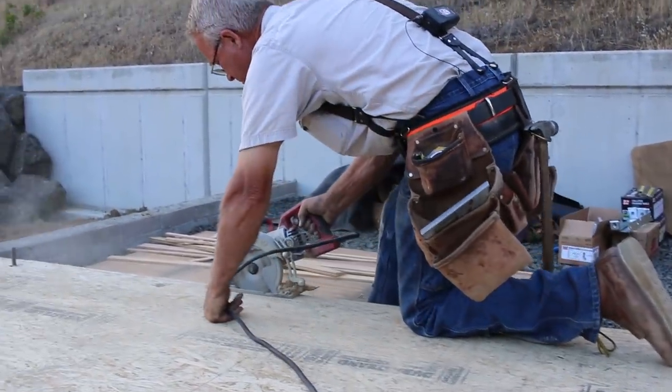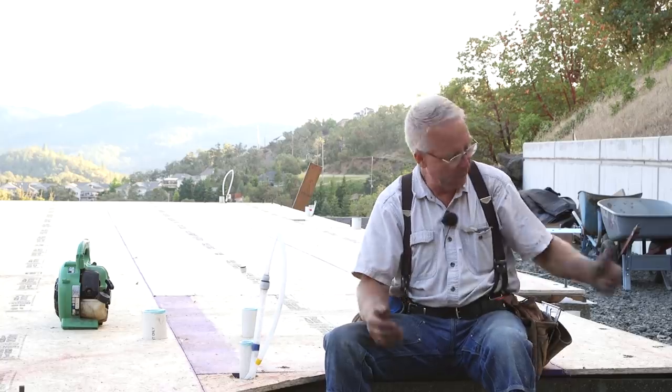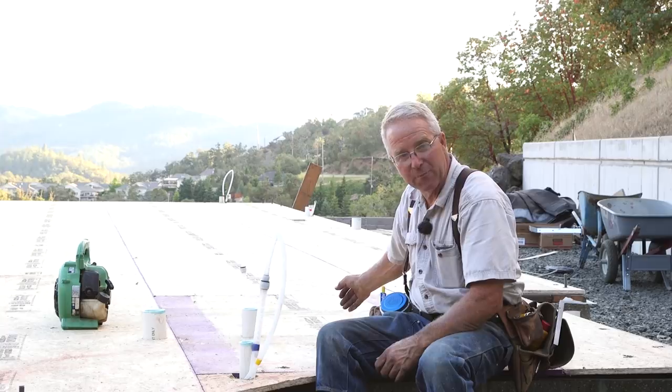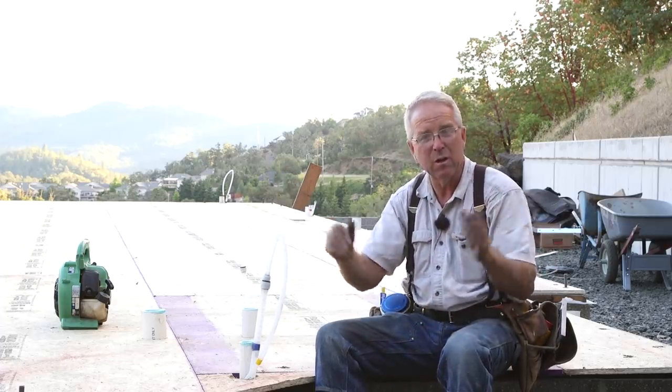Now back to the 5/8 of an inch net width reduction. If we were ordering trusses for this roof, or heaven forbid if the trusses were already ordered for this roof, I would have to reclaim that 5/8 of an inch someplace. And I would do it on the back of the house. I would let the deck, the diaphragm, stick over the edge of the stem wall 5/8 of an inch. And you know what? No one would care. It would not be any sort of a net compromise of the structure. If I turn around and realized, wait, if I do that, I'm going to have plumbing pipes intruding in the drywall, then I would let it hang over in the front 5/8 of an inch, which would be equally innocuous, although it would always bug me, but no one except me and now you would ever know. But we haven't done that. We've reduced the width. I'm happy with it.